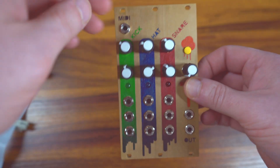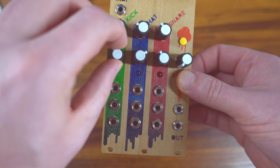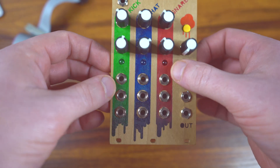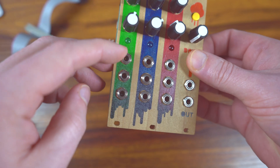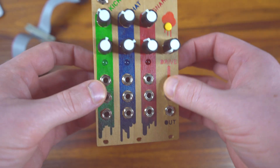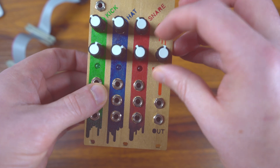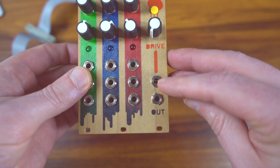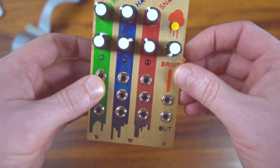The top row of each of these is the pitch control, and the bottom row is the decay of the amp envelope, and there's little LED indicators when they're actually firing. CV relates to the knobs — so pitch and decay — and then the bottom jacks are the gate inputs if you're not using the MIDI. It also has an overdrive wave folder just to distort the sounds a little bit, and that's also CV controllable. And everything is mixed down to this output here.